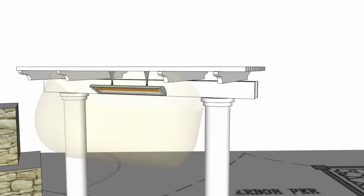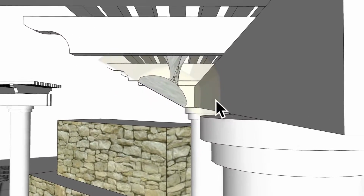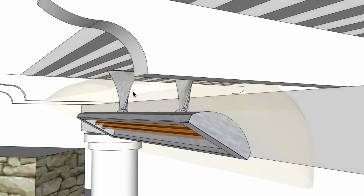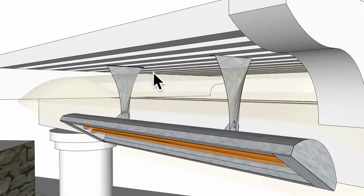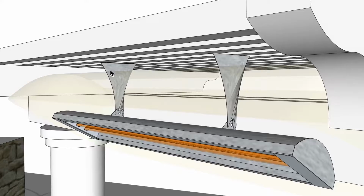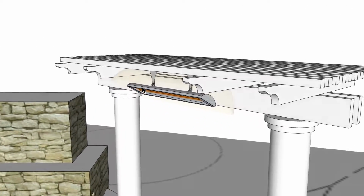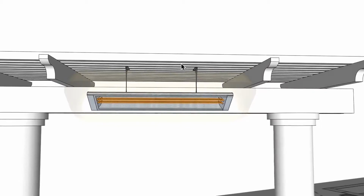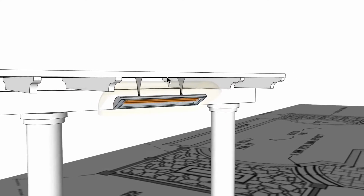Let's go ahead and look at the clearance above. So clearance above, you can see we had 6 inches behind, and then 6 inches is what we need above. However, with the OEM bracket that comes with the unit, we would penetrate about a half inch up here, or rather I think it's 1.5 inches. That's why I went with a 2-inch extended bracket that the manufacturer does make, and then you can just attach that up here to these eaves, or rather lattice work here.